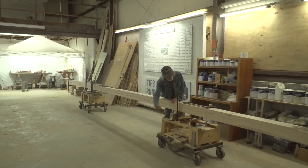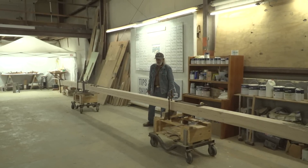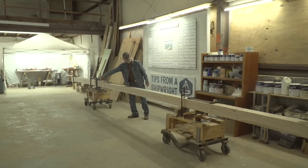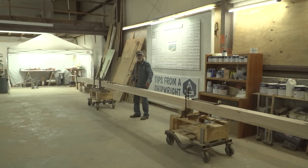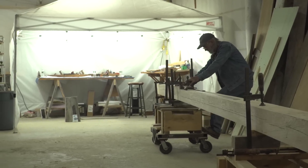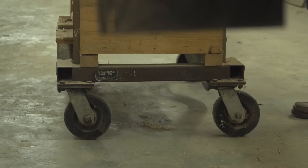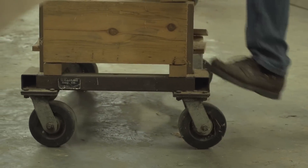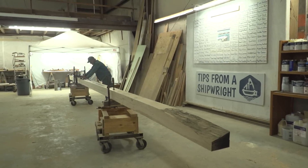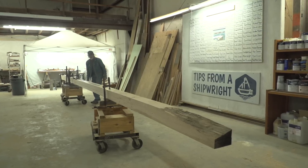We're going to put the other piece through here sitting on the horse with that end on our saw horse. This is kind of the way it's going to be built, but it's going to be built quite a ways over that way. The transom will be down there, the stem will be up there. We're going to swing it that way a little bit and give us some extra space while we're joining the forefoot to the keel. I've got it on rollers because that really makes it easy in the shop. That's just a temporary position, but that's exactly what we wanted.